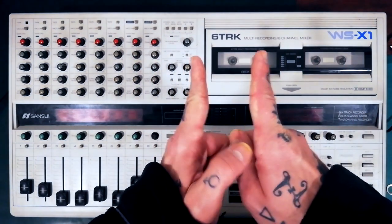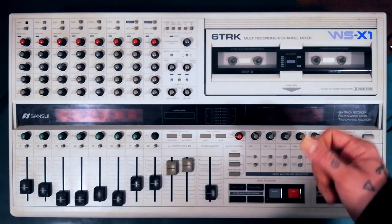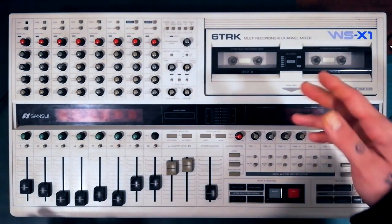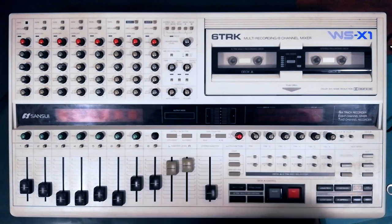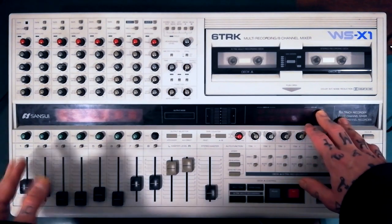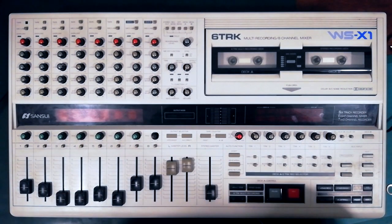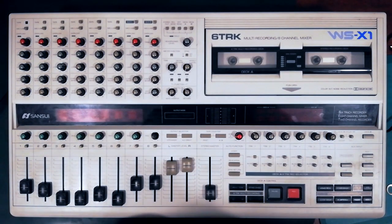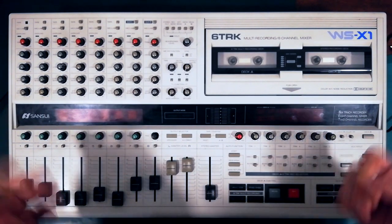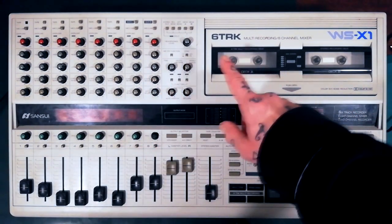Broadly speaking, wider tape at a higher speed means that the reproduction is closer to the capabilities of the human ear in terms of perceiving differences in volume and frequency. So when you have multiple tracks on one of these machines you're getting a bit of a compromise on fidelity in order to record more complicated music and do more overdubbing without bouncing down. The 688 had a lot of bells and whistles like a scrub facility, but the fidelity per track was going to be less than on a Tascam 244 or a 414 Mark II.